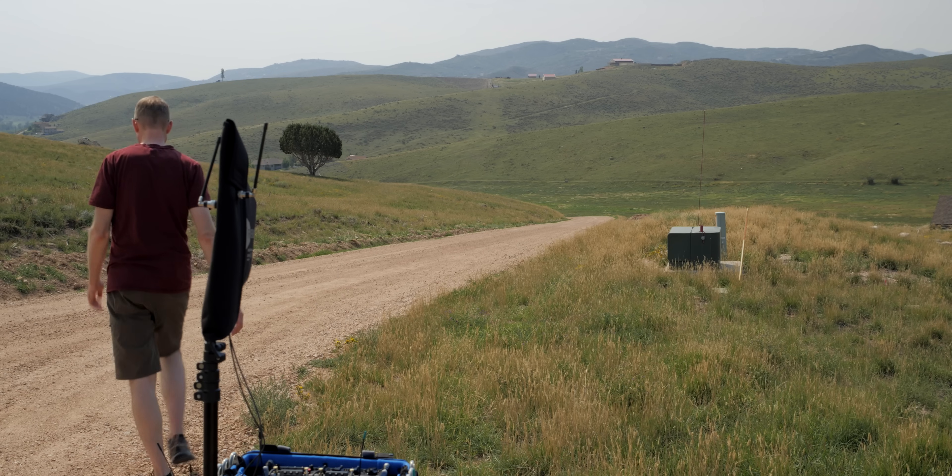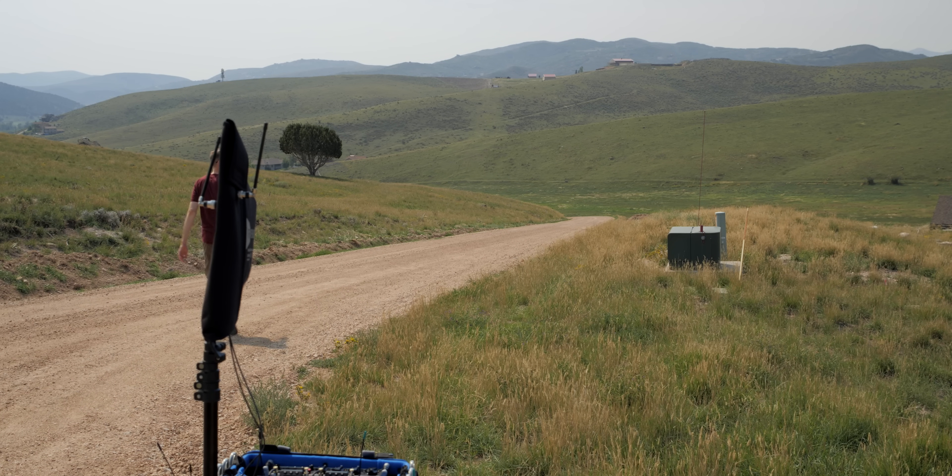Counting off steps to 25 meters. About 25 meters here. I've turned around so there's no more line of sight for the transmitter. The transmitter is in high power, the antenna is oriented vertically, and the whip antennas on the receiver are oriented vertically as well. I'll go ahead and turn the antenna so it is now oriented horizontally behind my back — and now it's horizontal line of sight to the receiver. Vertical, and then horizontal.